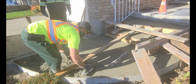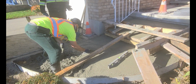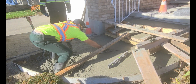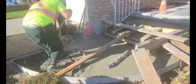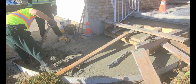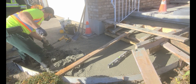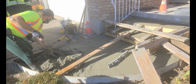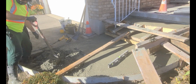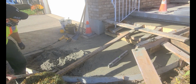I'll check the concrete numerous times with the float and just kind of feel out the ridges and the low spots, and do that circular sort of technique to finish the concrete flat. When I do these concrete pours, I'll always keep the tools I need within close reach.